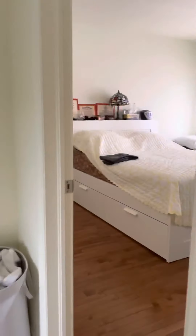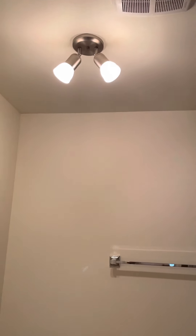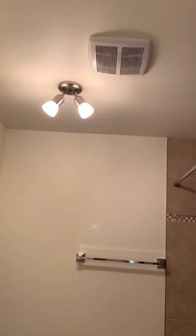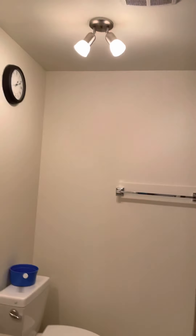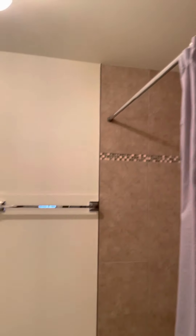Now in the bathrooms we have exhaust fans also, because if you take a shower you will use hot water and the moisture buildup will be too much. So after showering, I would suggest that you leave the exhaust fan still on — you can turn off the light because you don't need it. Then after about 10 or 15 minutes you can turn off the exhaust fan, so the moisture in the air inside your bathroom will be removed.